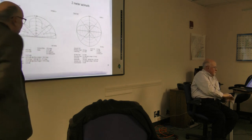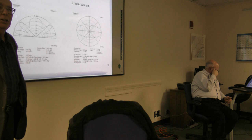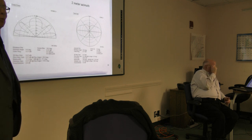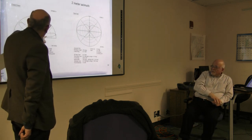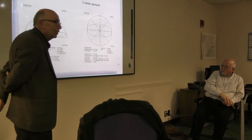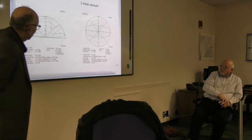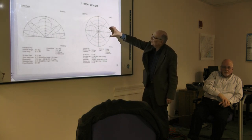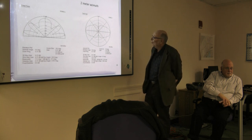It has some interesting properties. Now, either we have a miracle antenna, or we've run into the limitations of what happens when you do modeling. This is showing a very low takeoff angle with a gain of 9.37 dB, which is like working like a beam. And you look over here, and by golly, it's sort of a funny looking bidirectional beam here, with a fairly narrow lobe.